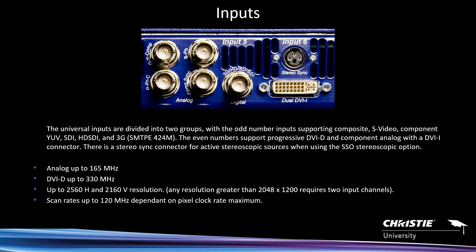The X20 can handle up to 2560 horizontal resolution or 2160 vertical, though you can't do 2560 by 2160 as it's too much bandwidth. When you use a dual-link signal on, say, input 6, that effectively disables the adjacent upstream input — so you lose input 5. Similarly, dual-link on 12 loses 11, dual-link on 2 loses 1. It requires two input channels and also requires two layers.